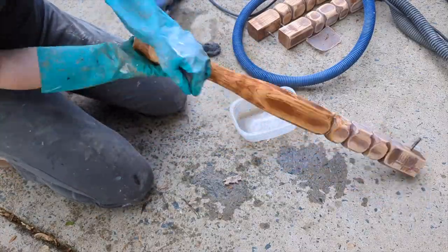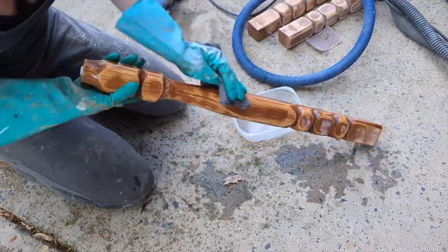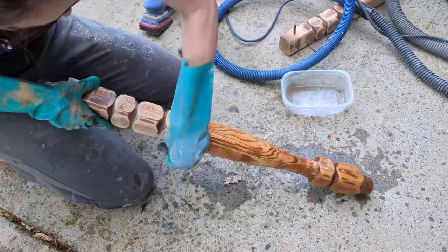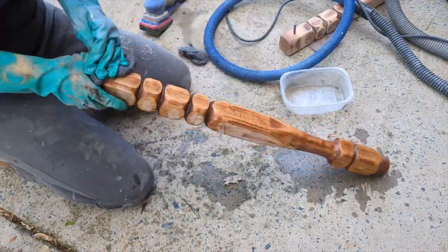Because the sander wasn't able to soak up all of the dust, I did go through and cleaned these again to make sure everything was dust free. That's the only way that shellac primer is going to really adhere super well — you scuff it up, but you also make sure the surface is fully clear of any dust and debris.